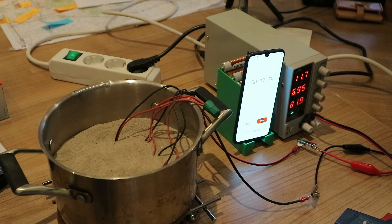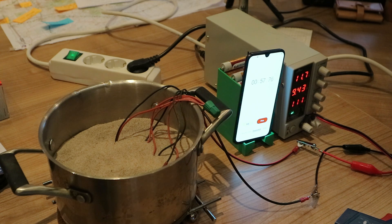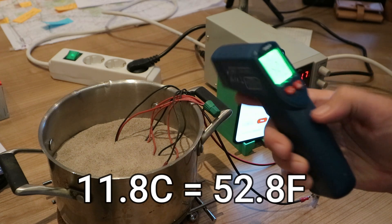This will probably run up to approximately 100 watts, something like that. Then over time it will drop back to about 50 or 45 watts. Once it's at that point, you will see that the fan will start to spin and generate heat somewhere in the range of 150 to 200 degrees Celsius. Right now it's at 102, 103 watts. The idea of this test is to show how far the wattage drops — the watt consumption. If you can generate 150 to 200 degrees Celsius with an input of around 50 watts, that's amazing. The sand right now is about 11.8 degrees Celsius, which is 52.8 F.